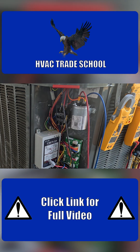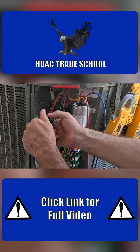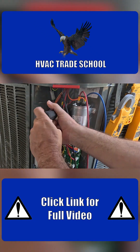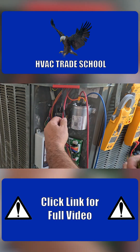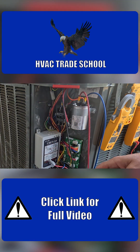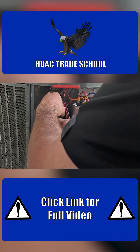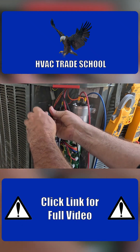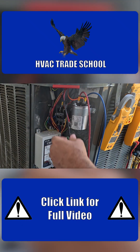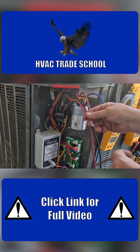We're going to go ahead and just take out the red wire — heavy gauge red wire — which gives us just a little bit of slack here. Make sure you put this screw back on the contactor, because if not, that whole top side will be loose and you'll have a burnt connection there. We're going to tighten that back down. So this is going to be in series with the brown wire.